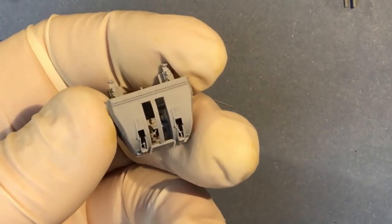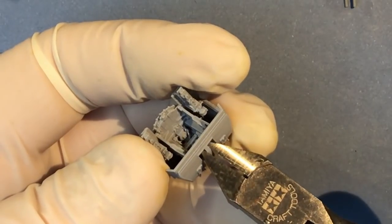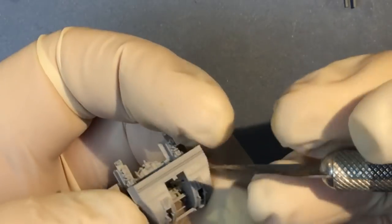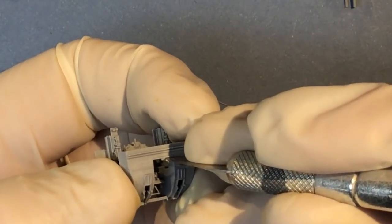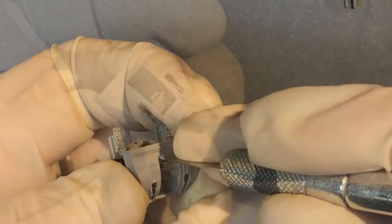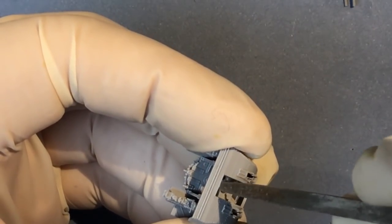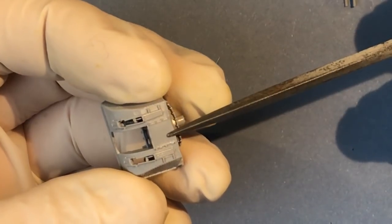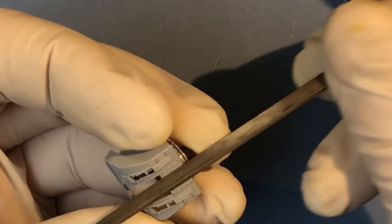That's all cleaned up now. On the Hood, this central strip on these QF mountings wasn't there - it must have been a different model of shield - so I just need to remove that. I'll use a brand new knife blade to clean these up because as I said the material is brittle and you've got a good chance of cracking these if you're using a blunt blade. I'll finish it off with a fine file - don't use anything too coarse on these. On all of these mountings there's a peculiar bump down at the bottom and I'm not sure whether that's intentional, but it looks a bit strange, so on all mine I've just flattened those out a little bit and leveled the bottom out.